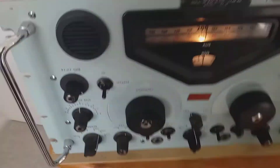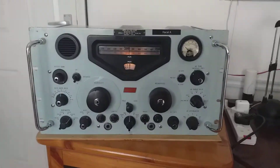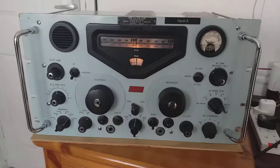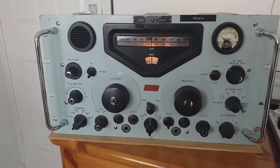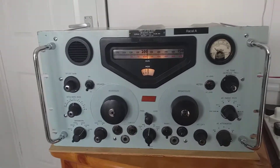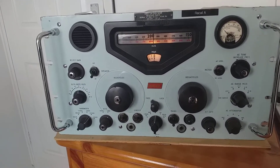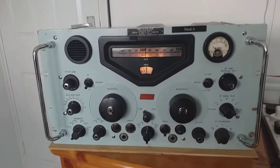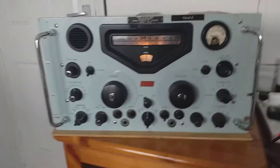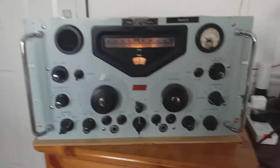The other method is just with an aerial. This aerial is quite a long one - it's for the top band, so it's really designed for 160 metres, around 1.8 megahertz, but I use it for general shortwave listening. The aerial is patched in on my patch panel over there - it's actually outside across the garden. Let me turn the volume up.